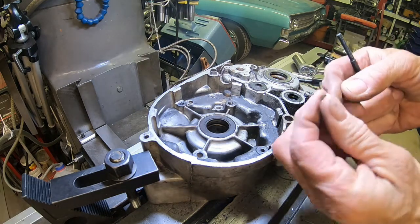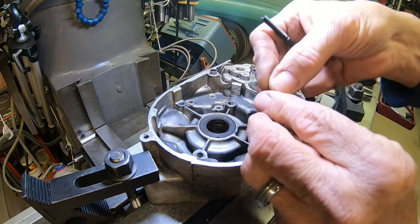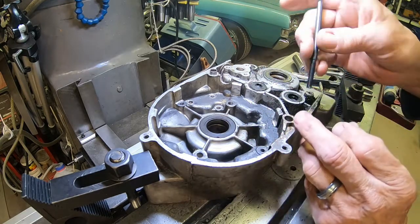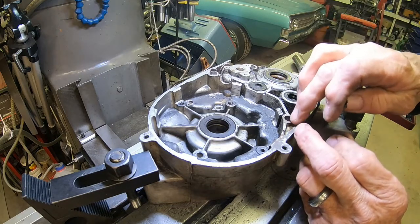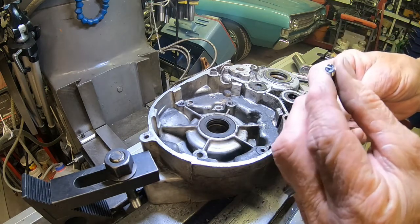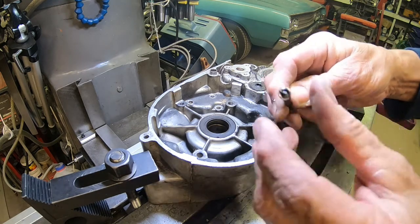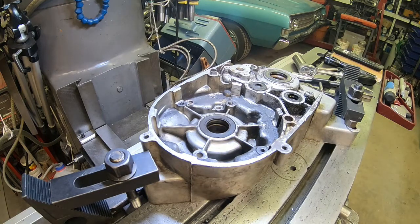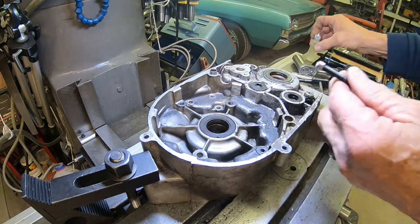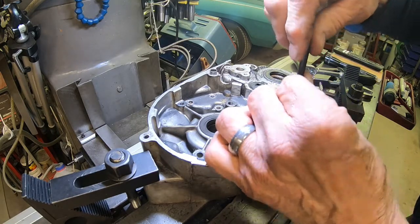Okay, here's the Helicoil that's going to go in there. It's like a piece of spring steel, and you actually have an installation tool here, and it has another part, but it's too far away from the top of the threads, so we're just going to use this portion of it. It comes around here and locks into the little tang sticking out right there. Now, what I'm going to do is just put a little bit of oil on that, and we're going to see if we can get a thread in that hole and go far enough down to do us some good.